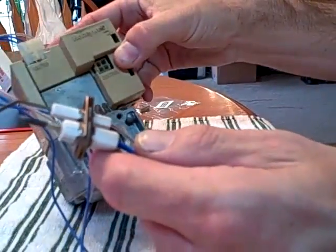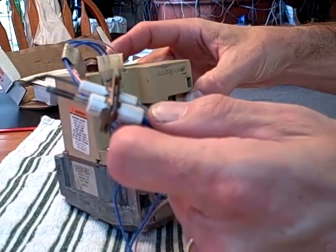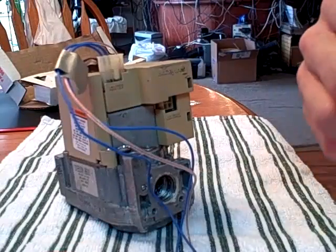The control four-port goes to the furnace control board. These are kind of hard to troubleshoot sometimes because the first couple I troubleshot I was pulling my hair out. You'd go out there, it would start, run, and shut off. Start, run, and shut off. And I'm thinking I've got a pressure problem, a vacuum leak problem, something blocking my pressure switch or something else. And it's not the case a lot of times. These things have little circuit boards in them and I think they develop cracks. It will decide at random whether or not it wants to acknowledge the existence of a flame.